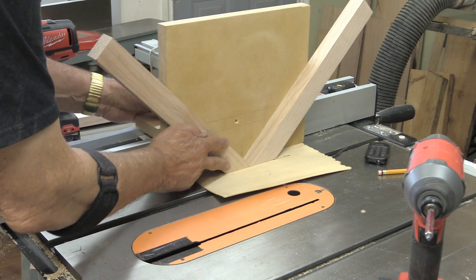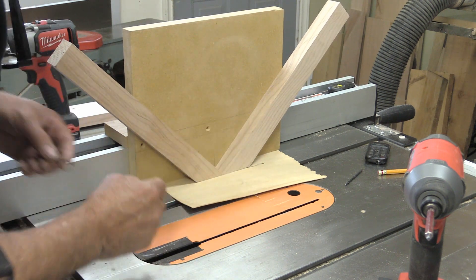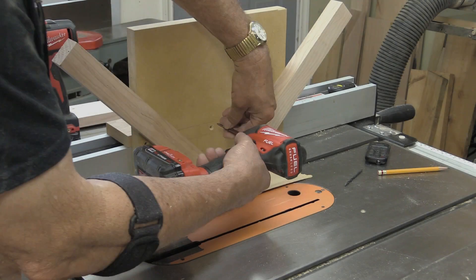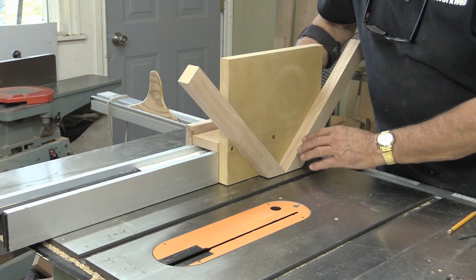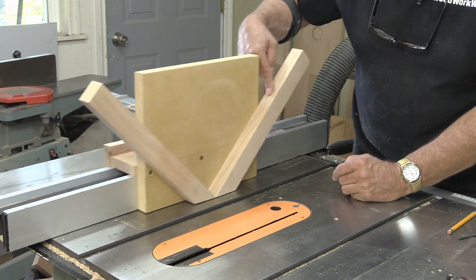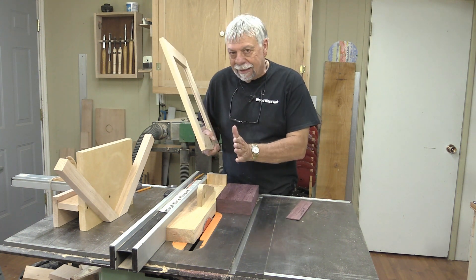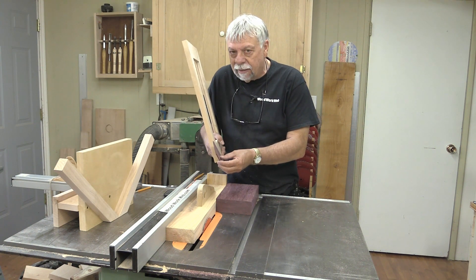Now the assembly needs to be done on the table saw. I'm going to have my hand in here driving screws into those pre-drilled holes we made earlier. We've got the veneer here so it's off the deck, and there it is — you can see it's lifted up off the deck, riding nice and smoothly. It's on top of the fence and doesn't take much effort to move it. The best way this system works is if you cut the blank first, then it's easier to sneak up on the cut. You may have to make a couple or three cuts to get a nice even cut in there.